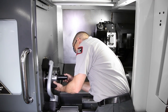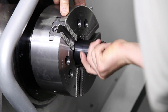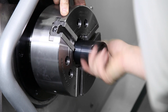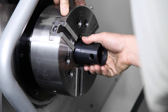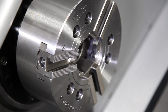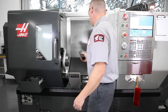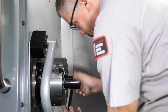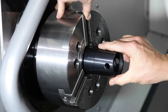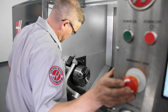With the chuck attached to the spindle face, look into the chuck bore to check that the draw tube end and the draw nut are well aligned. Andrew engages the nut install tool, pushes it inwards until the draw nut gently touches the end of the draw tube, and begins threading the draw nut clockwise, feeling for any binding. If any binding occurs, the chuck should be removed and checked for cleanliness. Once the draw nut is threaded on about halfway it will start to become tight to turn — stop rotating. Actuate the clamp circuit so the draw tube begins opening to the extended position, then e-stop the machine when the draw tube gets to the midpoint of travel. Continue tightening the draw nut until it bottoms out lightly, then rotate the draw nut back two and a half turns. A small adjustment in draw nut rotation may be needed to correctly align the travel indication marks on the chuck and master jaw.